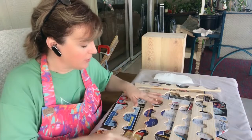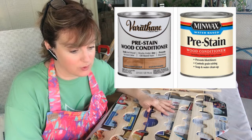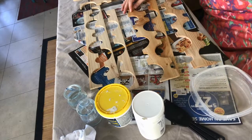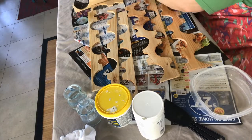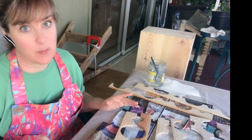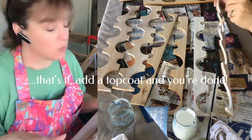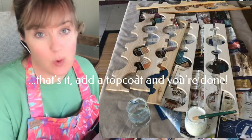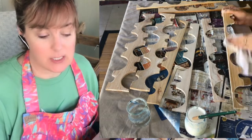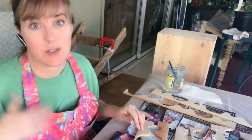Experiment time. Ordinarily, if this were a nice piece of furniture I was going to whitewash, I might use a pre-stain first. But because I'm practicing, I'm going to just use water to get the wood saturated. The classic, easiest way to do a whitewash is simply 50% water, 50% white paint — brush it on, leave it sit for about a minute, then wipe it off. You can do a slightly darker tone with 30% water and 70% paint, and just leave it on and sand it later. I'm going to go for the 50-50, one-minute-rest wipe-off.